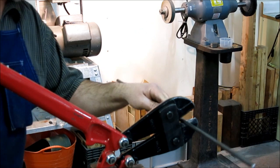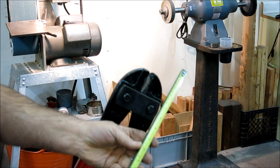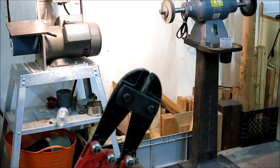We've got one marked for length here. I'm just going to use some bolt cutters here. These are 16 inches — 410 millimeters. Now, before you get carried away and go bend this thing, be sure to round the ends real nice before you bend it, because it's really hard to do after it's bent. So I'm just going to do that on the belt sander.